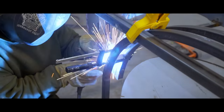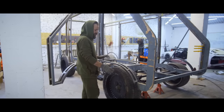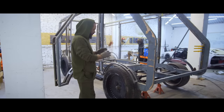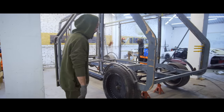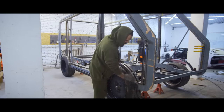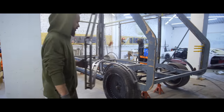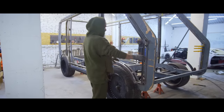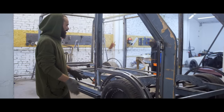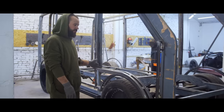After one day, here's what we've got. To install the bigger wheels, we changed the arches and increased the diameter — we cut out the old one, placed our gauge, made the new size, rolled the new arch frame through the pipe rolling machine, measured it, placed it, welded it. We had to redo the door too so that it doesn't overlap the arch, and we put a third hinge to avoid sagging due to the weight. Now it works as intended and looks much better. It's okay to make mistakes — we are not an engineering bureau, we come up with fun ideas and implement them, making concept cars.